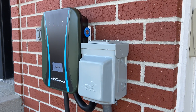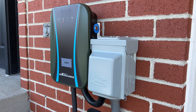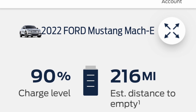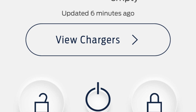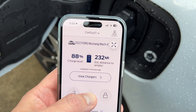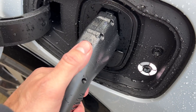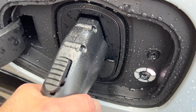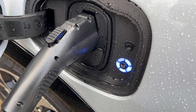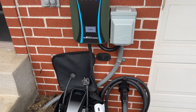I have been using this charger a couple of weeks now, and I did notice a condition where it's not ideal. Once the battery is charged on the Mach-E or any vehicle, it completes charging and turns off. But say you wanted to remote start your vehicle to precondition the cabin, or if the vehicle itself turns on to heat up the battery — which it will under very cold conditions below freezing — the charger will not output any more power. You have to unplug it from the vehicle and then re-plug it back in for it to do the handshake and start charging again. This is not ideal for parking the vehicle outside. I'll still put an Amazon link below to the product because it is a well-priced charger for all the features it has.